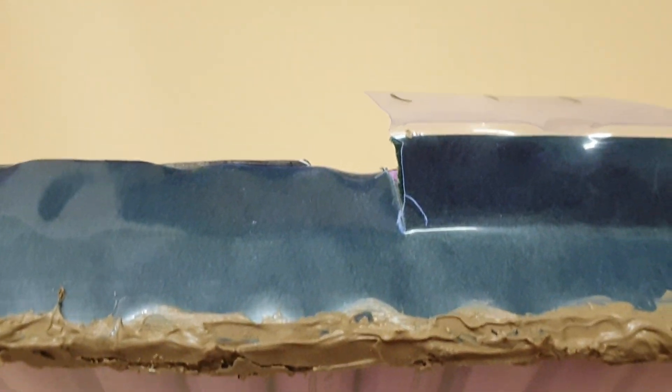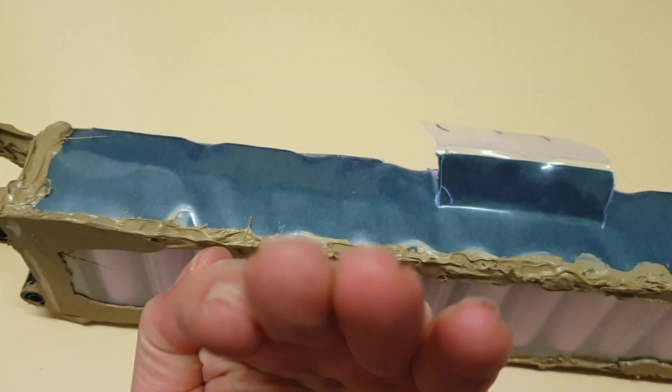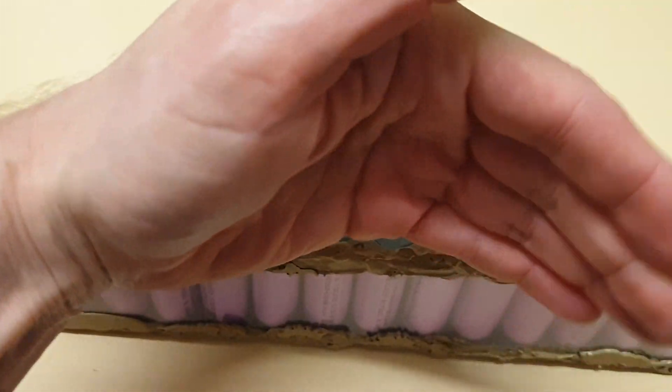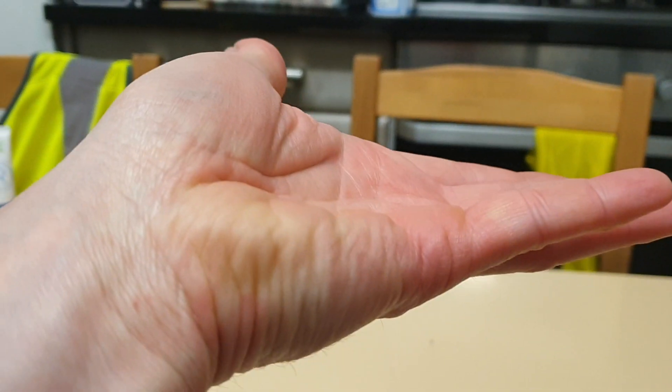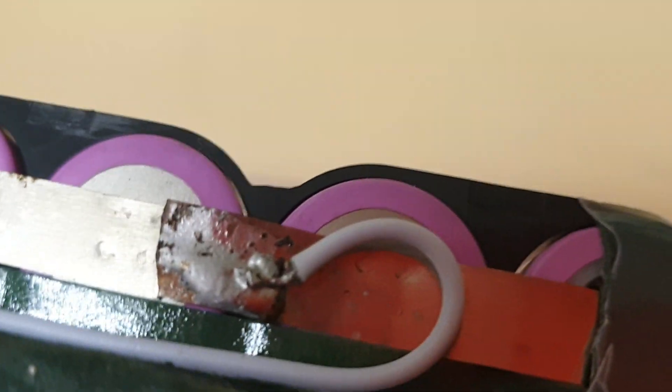The reason is that the battery is heavy. As you ride, the middle is bending with the battery — it bends like this, bending because the battery is hanging heavy in the middle. From that bending you get this crack. I'll try to bend it manually right now so you can see it — you can see it's getting a little bit further apart.